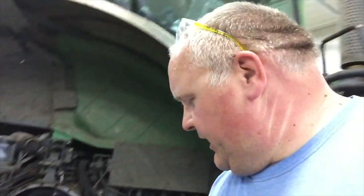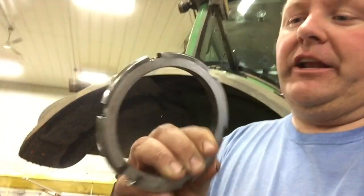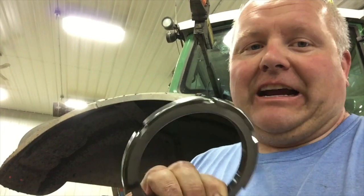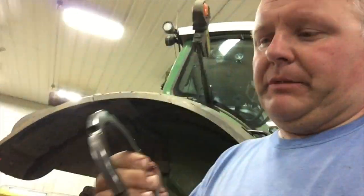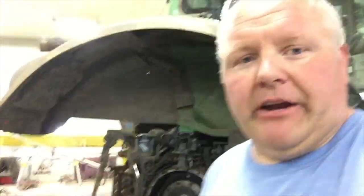But the hardest part is this round nut. Our dealer does not have the socket to tighten that in. And in the assembly, they're saying that's gotta be tightened up, preloaded to 250 Newton meters. So I don't know how I'm gonna do that. I might have to make a socket or something. But anyway, in the meantime, we'll get ready for the assembly.